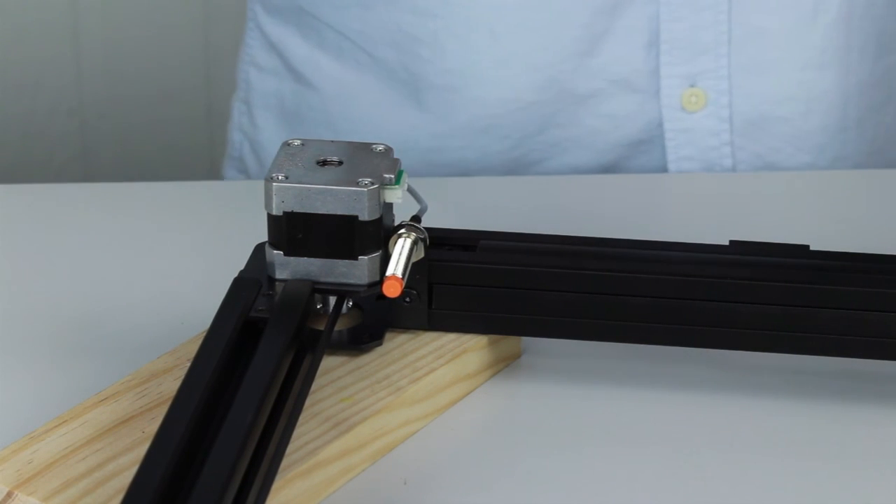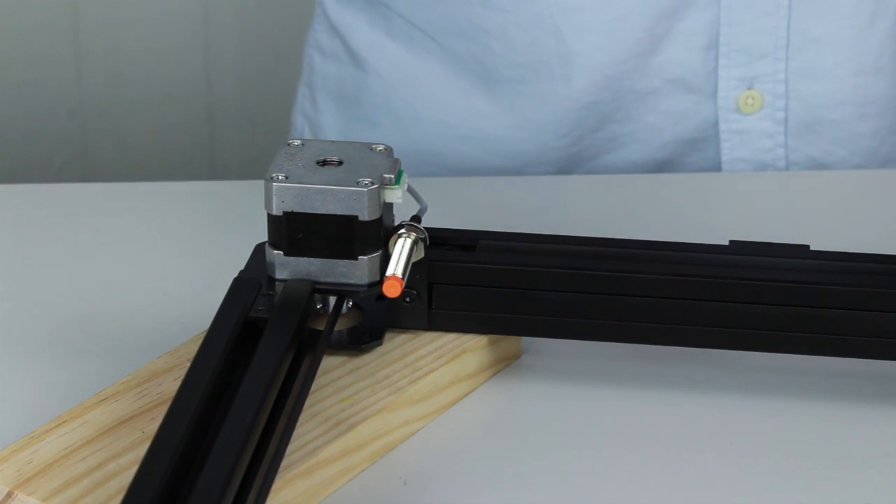Once the nut is in there and flush with the edge, take one of the limit switches and one of the M5 flat top screws — pop it in the hole of the mounting bracket and screw it into the nut. Put it in loosely first, push it hard against the corner bracket as far as it'll go, then tighten it up. Do the same on the other side — rectangle bolt in with the long side vertical, guide it in with the hex key, then install the second limit switch with the M5 10mm bolt and push it hard up against the corner bracket before tightening.